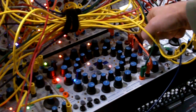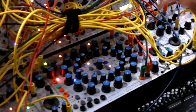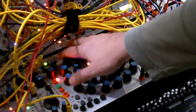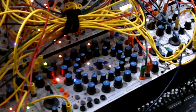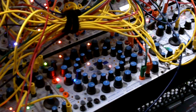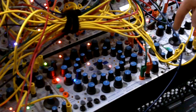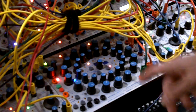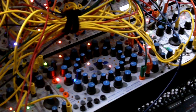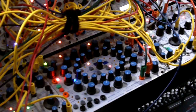You have to have some pulses, and you have to actually tell them to be on. In edit mode, you have to actually push the button to get it to come on. Make sure you're pushing one and not two, and this is selected to one on the voltage outer ring, which is your CV output level. The simplest connection is literally take the CV out, stick it right into the oscillator input, make sure this knob is up all the way. We're just doing a test, so turn it up all the way. Then turn the pitch knob all the way down. Your pulse you could stick directly into the 292E control voltage input - it's firing, it's pinging it - or you could use the attack decay generator, function generator.